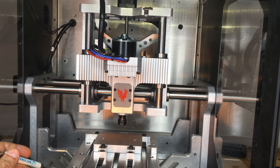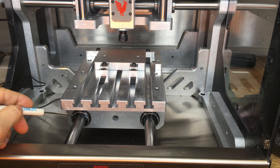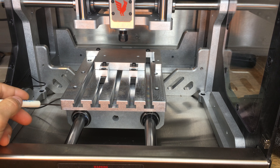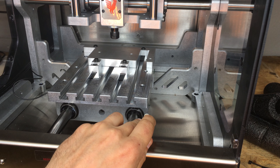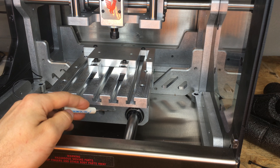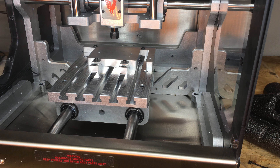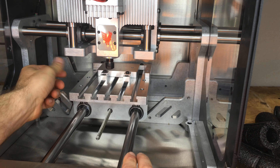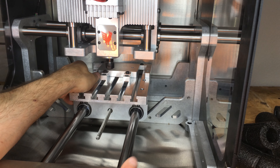I had been curious how they're getting their probing surface. I thought maybe they were using non-conductive bearings — like a ceramic ball bearing — but actually they have a tiny little gasket on the side, it's green, and that's to basically prevent contact between those surfaces. Then they're running a wire to complete the circuit. You can see the motion covers quite a long distance — the entire t-slot plate distance forwards and backwards.